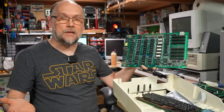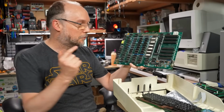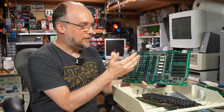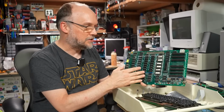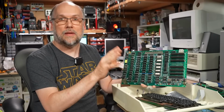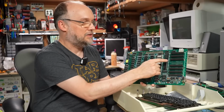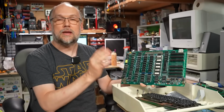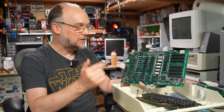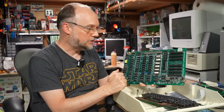Well, I think I'm going to end this video here. This motherboard has put me through the ringer. I'm not sure I ever had something as difficult to fix as this, at least when it comes to those problems with those shorts. Those are bad problems to fix, and I've never run into a board that had shorts like that which were not caused by some kind of rework that someone had done in the past, where they put too much solder or lifted a trace and that caused a short. This thing had 2 of those that are some kind of manufacturing defects that must have been okay enough to make this thing work when it was new, and then it got worse over time.